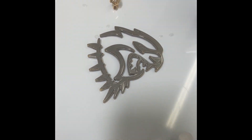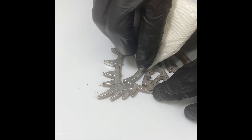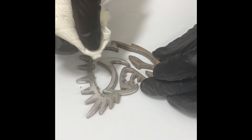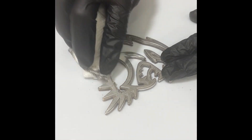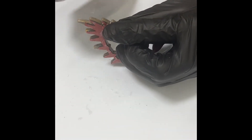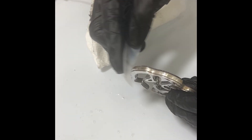This is great for you guys to know. As you come across different chrome-plated items, it doesn't necessarily mean that they're actually chrome plated. What you're seeing here — where we can rub off that gold — is a good indicator that this is actually fabricated out of aluminum, not chrome plated. You can see it just coming right off on the rag. We can also do a tape test, and you can see the gold comes right off on the tape as well.